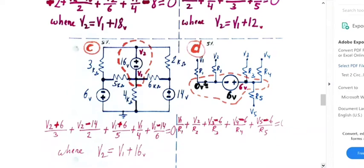Yes. V2 be negative? Which one? Part B. Shouldn't V1 be negative? 0 minus V1? And 0 minus V2? Correct. Very nice. I'm glad that you saw it. But here what we did is, the answer is correct, I'll tell you why. Usually we did outgoing, outgoing, outgoing, outgoing. What we did here is incoming, incoming, incoming, incoming. So it's the same idea, right? But if you do outgoing, you're absolutely right. So we have incoming, plus incoming, plus incoming, plus incoming, plus incoming. That's what you see here. But if you do outgoing, you're right, it should be negative. Good, thanks.